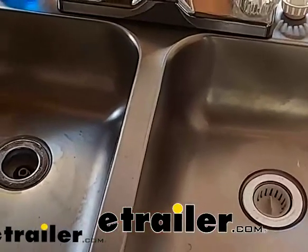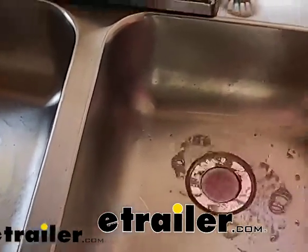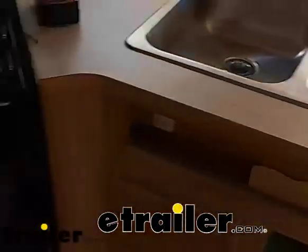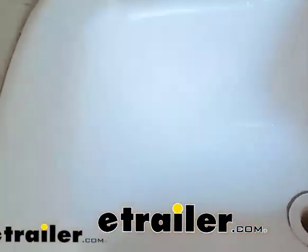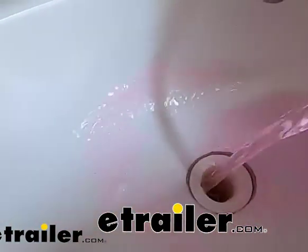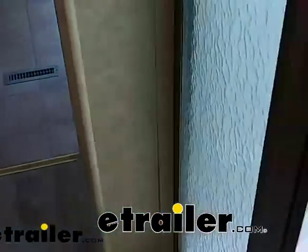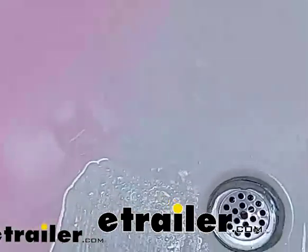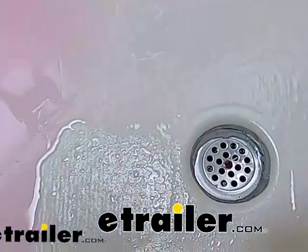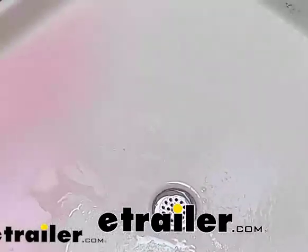So like I said, you want to take a little bit of the antifreeze and dump it down to fill up each of the P-traps, just so they don't freeze over. Your toilet is going to go straight down into your black tank typically, so you shouldn't have to worry about doing that. But definitely a sink or a shower, you're going to want to do that. The P-trap's there to stop any smells from coming from the tank itself back up into the camper.